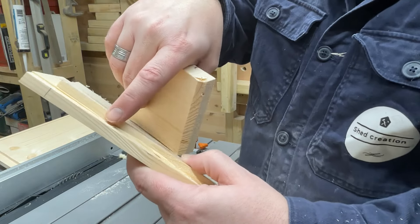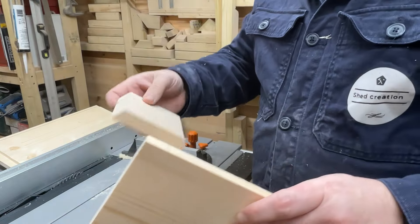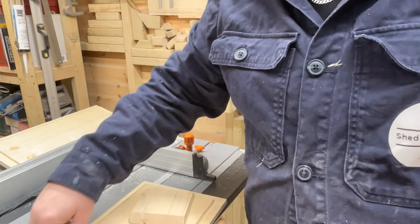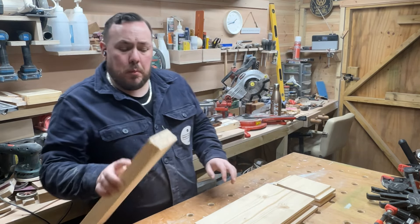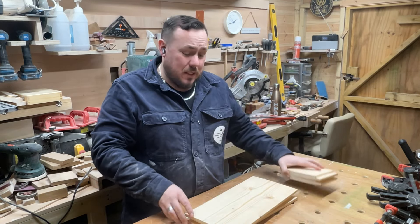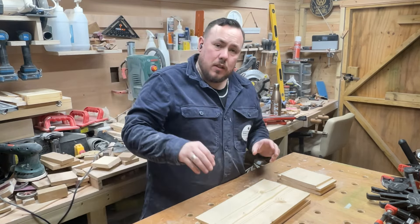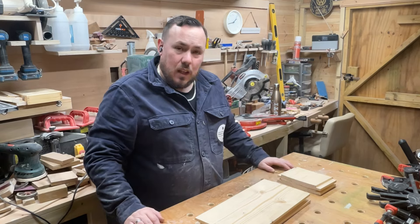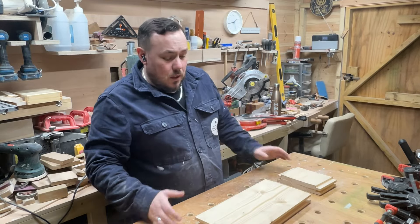They do need cleaning up a little bit - a bit rough - but that's what it's going to sit like, and it'll all be snug so it'll look like one piece. I'm going to run these bits over one more time to clear them up. We now have all the bits cut - the top and bottom, the end pieces, and the front and back panels. All I'm going to do now is glue it all together, clamp the heck out of it, leave it to sit, then measure and cut through with the table saw. Let's start cleaning it out.